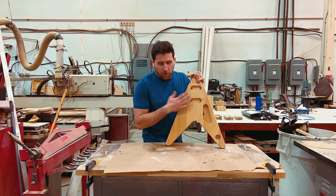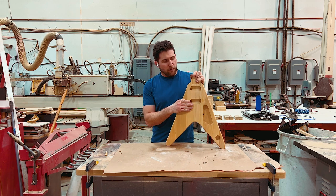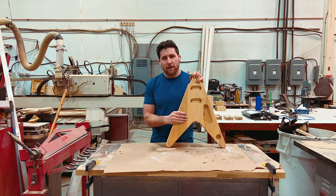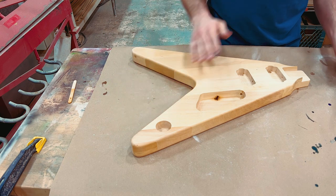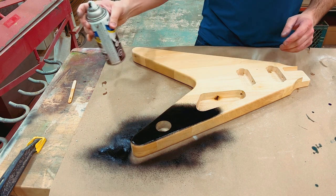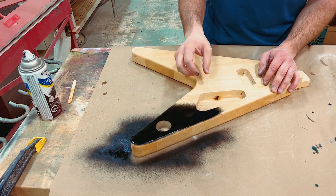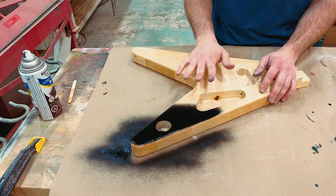In that same theme: surface preparation. It's not just the conditions of the area around you that matter — it's the conditions of your surface. On a piece of wood like this, there are some things I need to do to make it paintable. I can just shoot paint at it, but it'll look terrible. This piece of wood has one coat of sealer on it and is not properly sanded. So when I spray it, you will see as it dries that it looks very rough. Some of the paint gets absorbed, some creates texture. That's preparation.